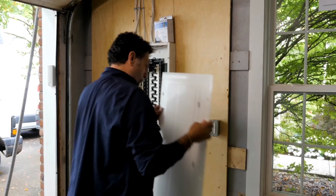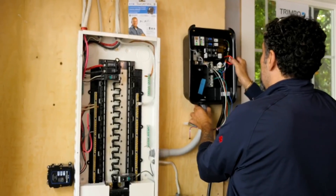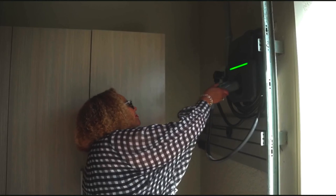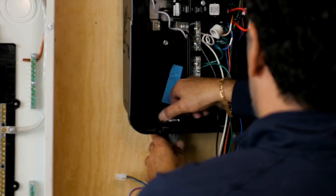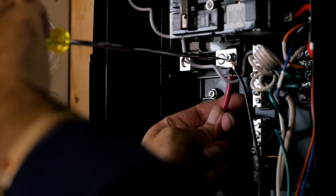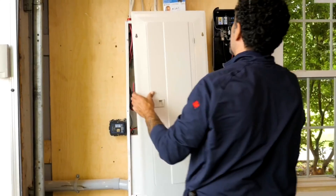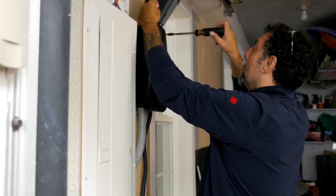The next thing you want to do is hire a licensed electrical contractor. They will assess your electrical system to make sure it can handle the additional load the EV charger will put on it, and it could lead to upgrading your service depending on what you have now. A lot of homeowners don't realize that an EV charger is probably going to be the largest load on your panel, so you need to have that assessed. If you do not have the right size panel, you could have a fire. A licensed electrical contractor will help you spot any of these issues.